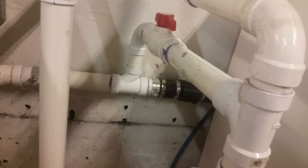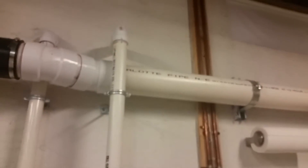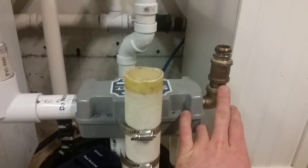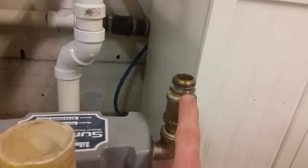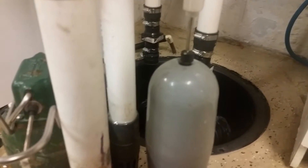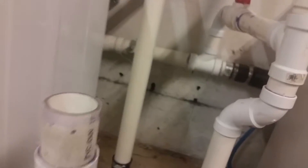So let's say that one was to clog and fail — it then goes up to the outside of the house. And let's say this pump was to fail or we were to lose power. Our second backup is the sump jet — Liberty Pump's SJ10. I like this pump. It's powered off your municipal water. I have a municipal water flex line right there that goes on top. When you get that 60 psi high volume, high pressure water coming through, it pulls the water up and outside of the house. It has its own line, its own check valve, goes outside of the house.